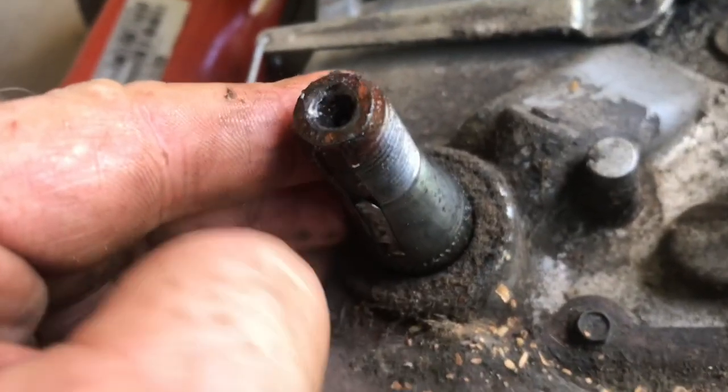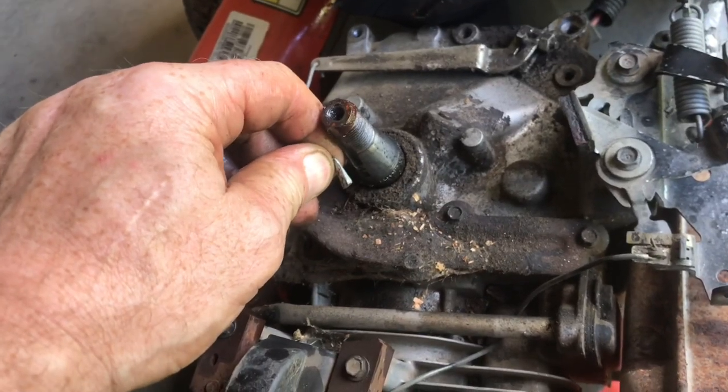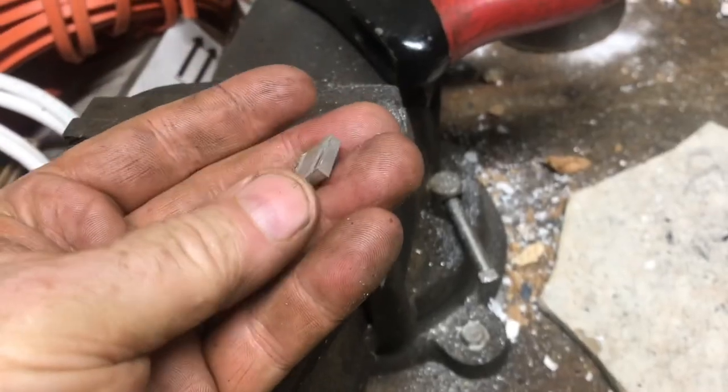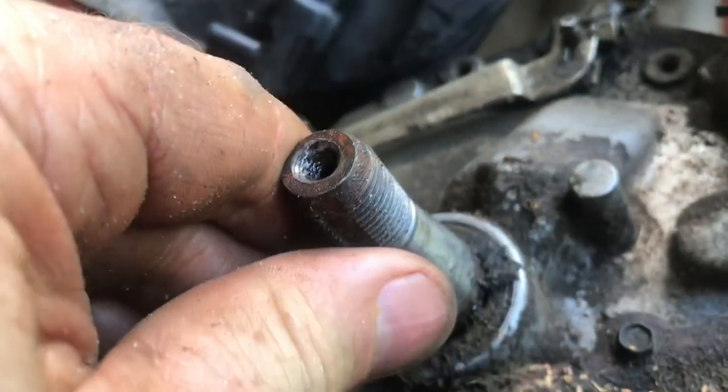Right here's that sheared pin. We'll need to buy or make another aluminum shear pin. I don't have a shear pin, so I'll just make it out of this block of aluminum. Cut a piece off with a hacksaw, make sure it fits nice and tight, file it until it fits perfect — it fits in there real nice.